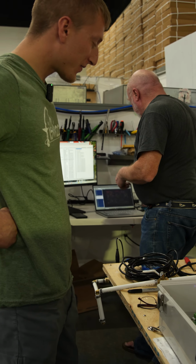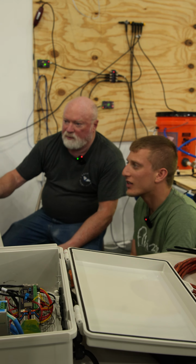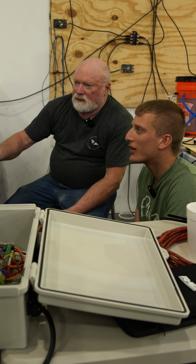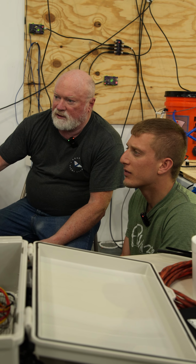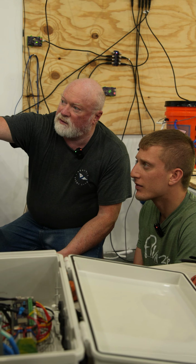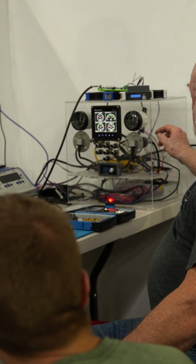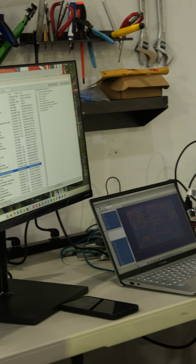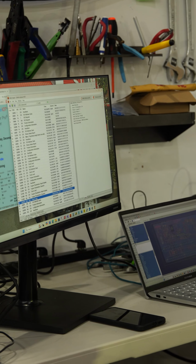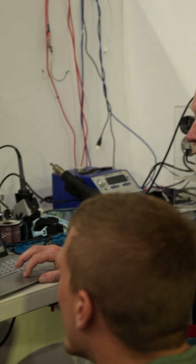If we go over here, this is NMEA2000 stuff, and this is what you see for the various messages on the bus, and I was talking to you earlier about things like fluid level. This is simulated? Yeah, this one is an engine controller that's simulating 618 RPM over here. And you can see the fuel tank level as I increase or decrease it with the float. Then up here you'll see the fluid level is just what we just did. So it's either this one or the other one. I guess it's the other one.